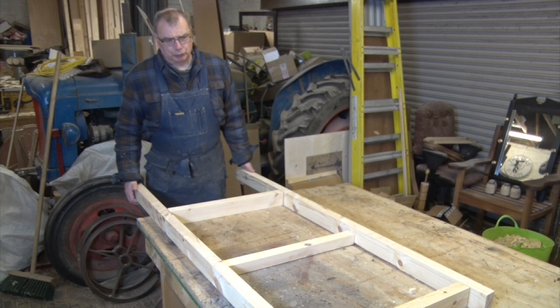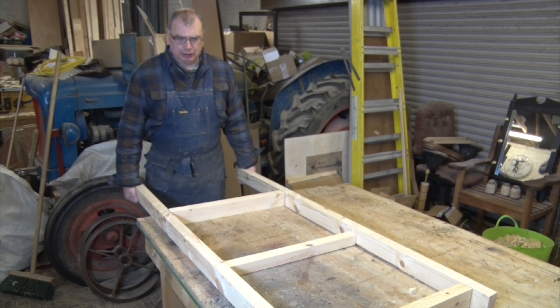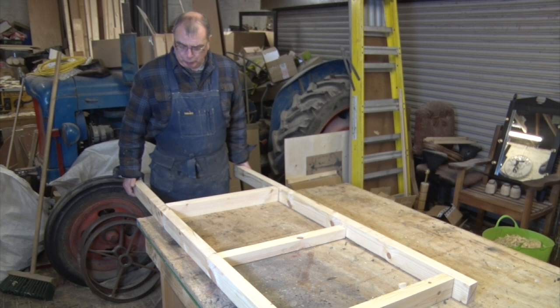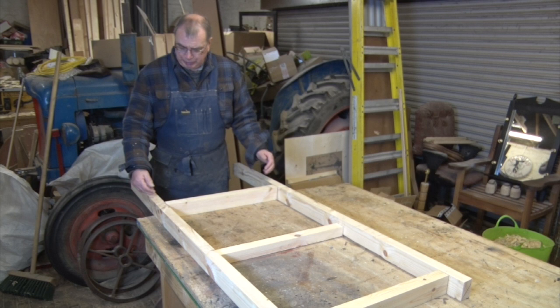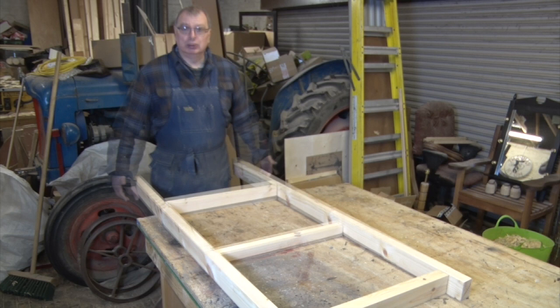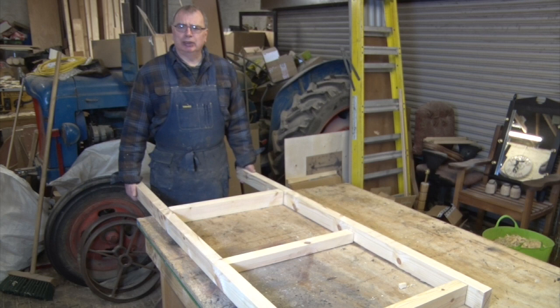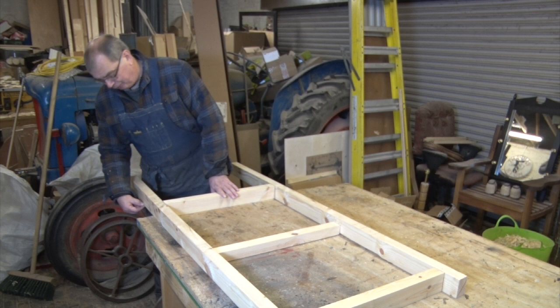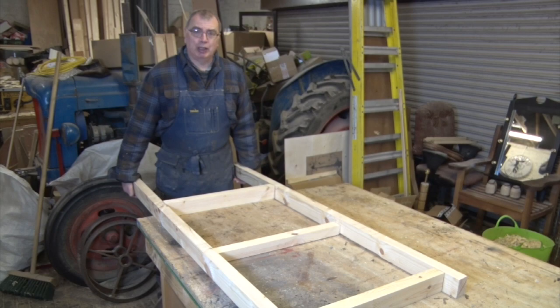Well there you are, that wasn't so bad - only about another 20 more to go. So this is the basic frame that's had mortises and tenons all the way through. I've not glued it yet, it's just sort of held there by friction. Now the bit I'm holding on now, this is going to be the handles. And then we've got some legs to go down from there. Up to now it's been pretty boring everyday woodwork, but now we start to get a little bit more interesting. The first thing we need to do is to make the handles. This bit here is going to be the handle - I could just leave it like that, but it's not a very comfortable handle. If you were holding that for some time and going some distance, I'm sure that would be quite horrible. So what I'm going to do is cut along that bottom there and then start shaping these two handles into much more of an oval shape.